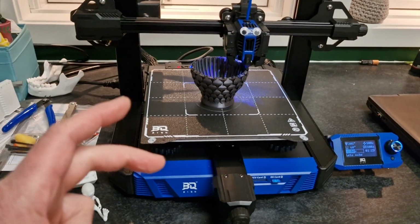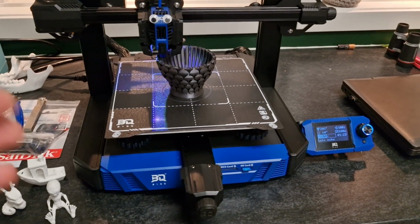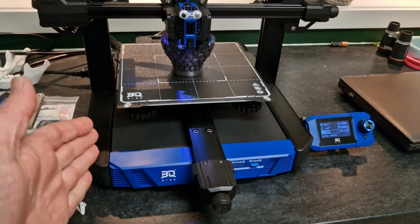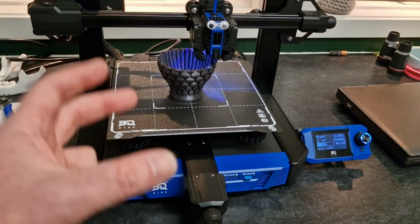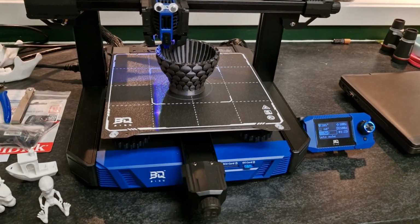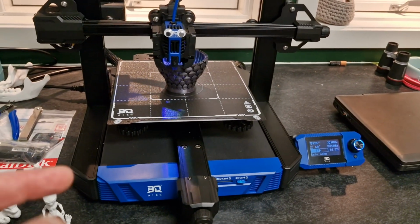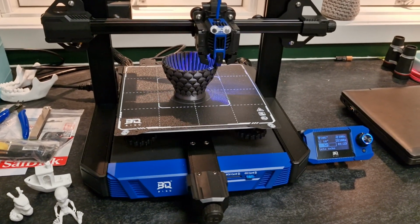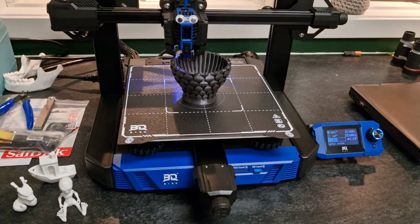Then you click it onto the various types of boards. In the case of this one, maybe I'll figure out how to put a picture up, but if I don't, this is a main board with a slot where that CB1, which is BIQU's version of it, or believe it or not, a CM4, can both click onto. So you can actually put a real Raspberry Pi CM4 on this board in the future if you have more Raspberry Pi experience. Now the CB1 is running Debian Linux. Debian 11, I believe, and then it has Klipper and Mainsail as the UI, if you're familiar with those things.